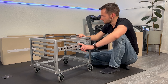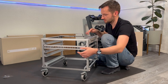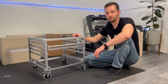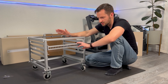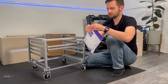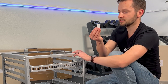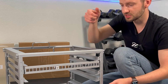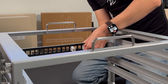What's notably different here is this patch panel — it doesn't come with the strain relief that would usually go on the back of the regular keystone patch panel that they have. To keep things simple, usually when you do a full install you'd have to terminate your ethernet cable in the back with RJ45 keystone jacks, but to keep things simple — and they even show this in their instructions — use keystone couplers instead. I have a pack of 25 linked in the description and you just need 24. You grab the coupler, the bottom end goes in first and it just clicks into place.